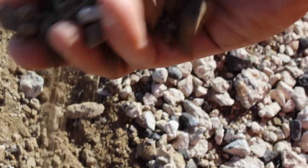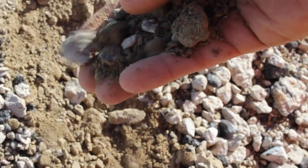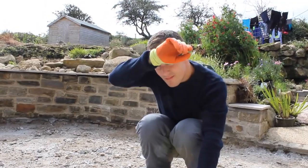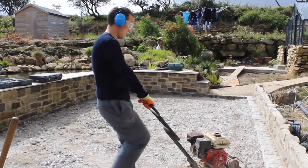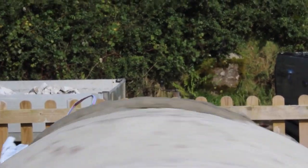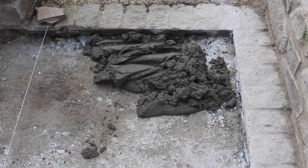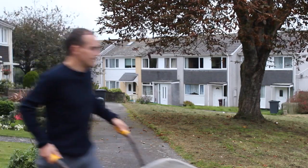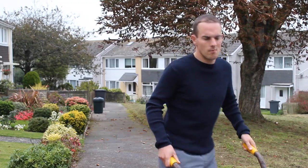Step 7: Build up the layers. Once you are happy with the subgrade, place a geotextile down to separate the subgrade from the sub base. Next, it's time for the sub base — remember to check your levels as you go. Use a wacker plate to compact it. Add in some sharp sand to blind off the sub base. Now it's time for the bedding layer — a mix of 6 parts sand to 1 part cement is a good ratio. For medium or heavy duty driveways, concrete will be needed.